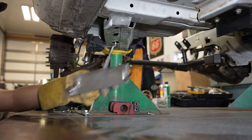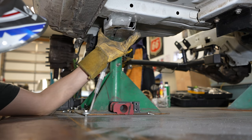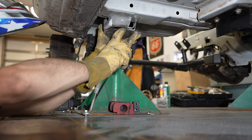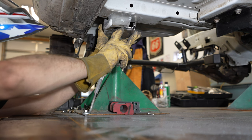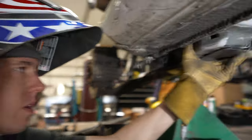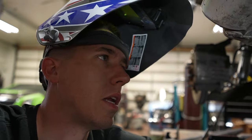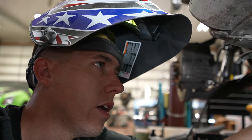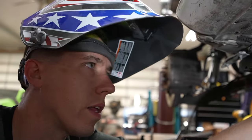On this first try, since I can't really use any filler material, I'm just going to try to hold it in place. I can tell right here there's some extra little material from a pinch weld, so I'm going to weld right there and try to bridge it to hold it in place, and then I can get up in there and tack another piece. Whenever you're tack welding something like this, you don't want to go too much or really weld it in there, because then you won't be able to get it off very easy — so definitely put your tack welds anywhere where they're easily visible to cut, so you can remove it, pull it back out, and weld it all up.